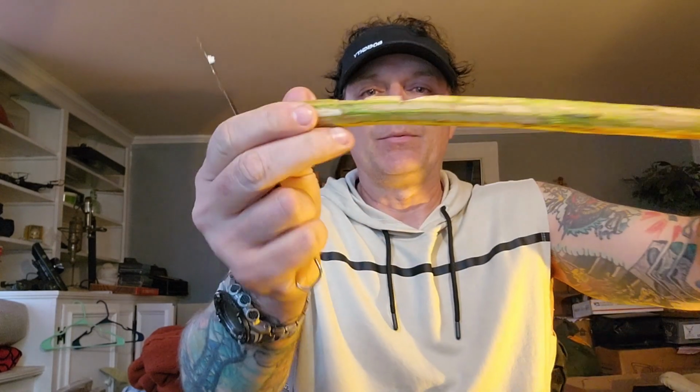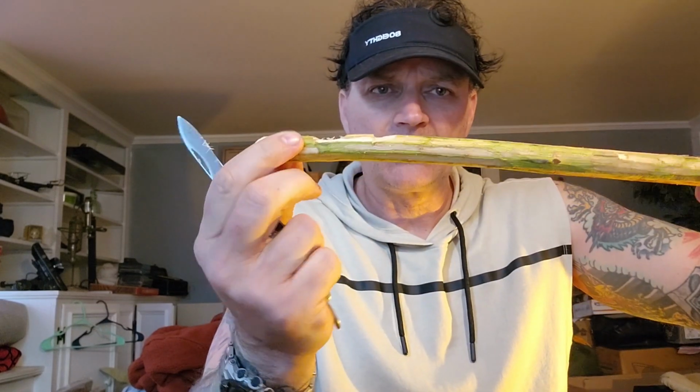So now I want a 90-degree notch. So for the 90, all I'm going to do is dig straight down. I'm going to wiggle my stick, wiggle it just a little bit, and then I'm going to go at an angle, and I'm going to try and catch to the point that I just wiggled down to, and that's going to be my 90. So pretty simple. That is a 90 to go with my hairy looking saddle. If it's not perfect, it's going to mess with my head. So saddle, a blunt end saddle, and a 90.